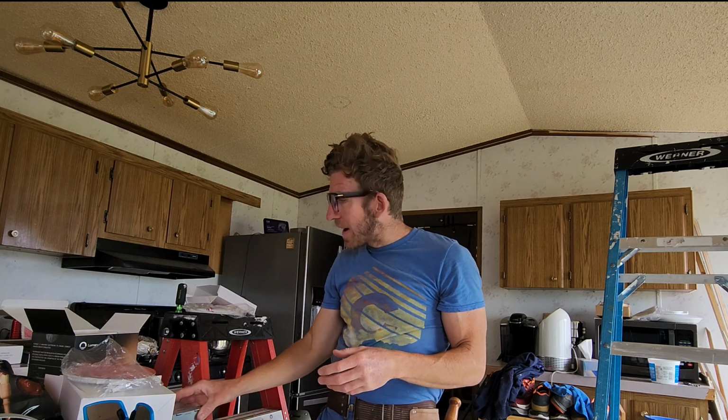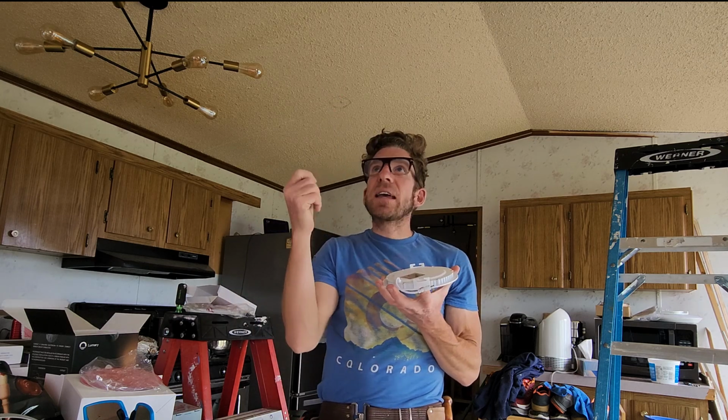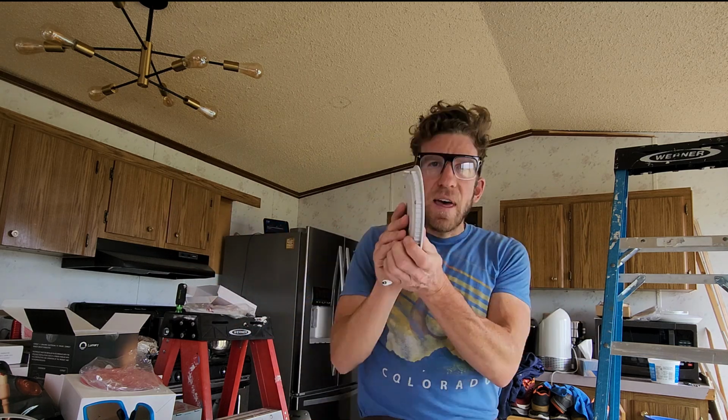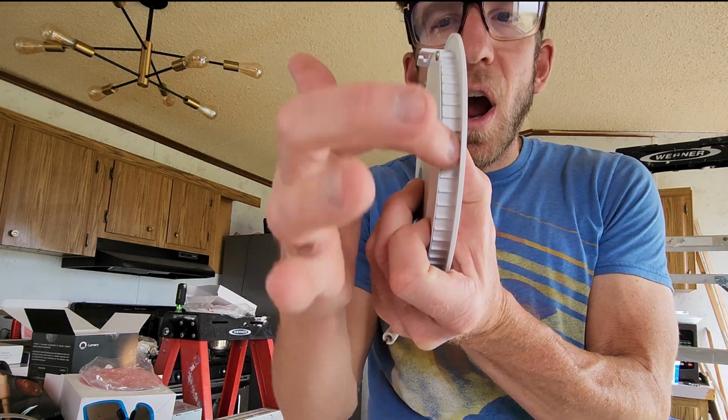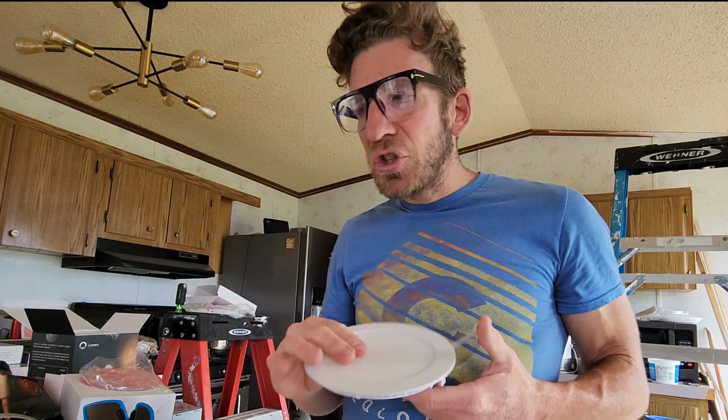And these are so thin, if I didn't mention it, well, I'm going to mention it: if you hit a truss, like if the perfect positioning is where a truss runs straight through your line, you're like, oh, I can't put my light there. Now I got to repair this hole. These are so thin that they'll sit between your 1/2-inch drywall and your truss as long as you clip them in, obviously, in the opposite direction of your truss. I had that issue in my master bedroom, and I think another room as well, because sometimes you want that exact position. You don't want to move it over. It's not going to mesh well with the room.